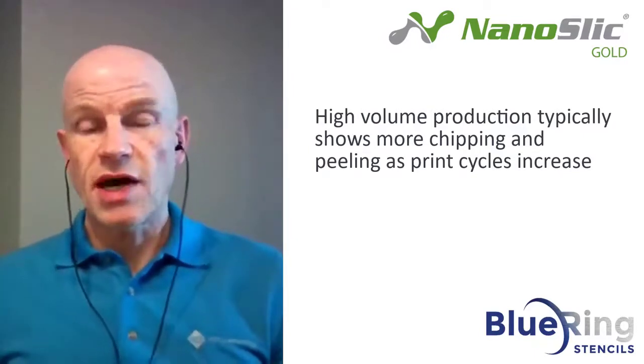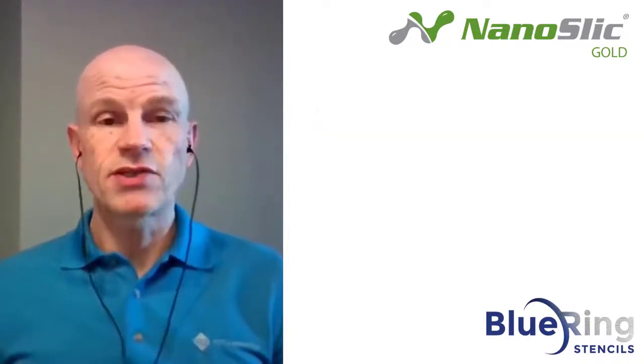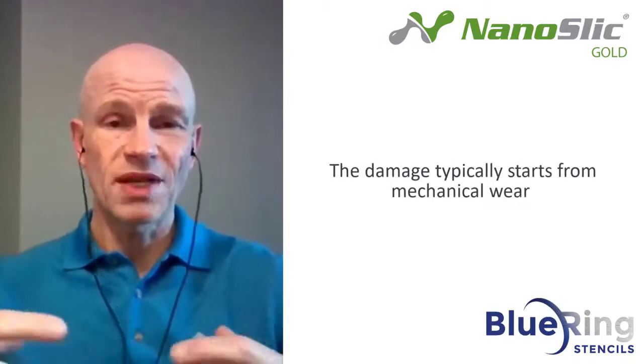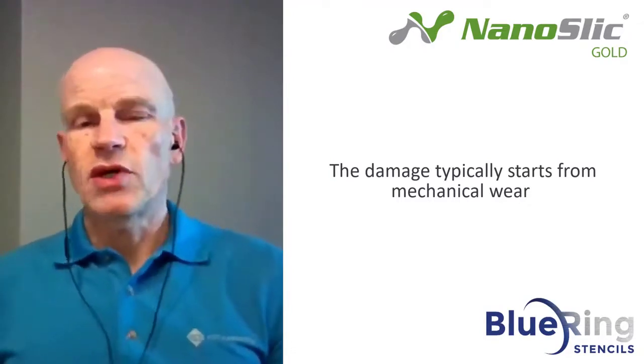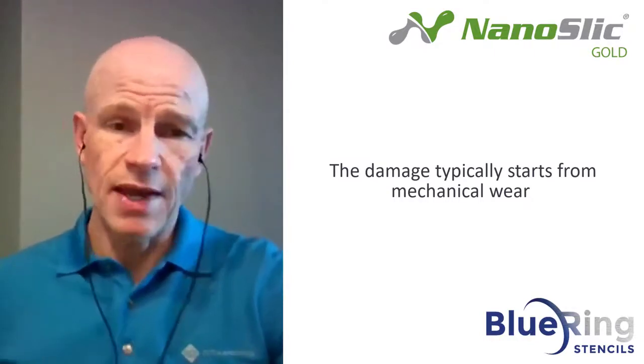And you can actually see the high spots of the circuit board eventually get translated up into the steel of the stencil itself. The pressure is great enough over a period of time that the steel gets deformed and bent permanently with the circuit board image. And so that's really where the damage begins with the coating. It's a mechanical type of damage, not a chemical damage.